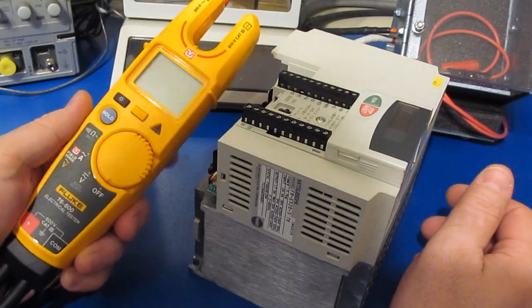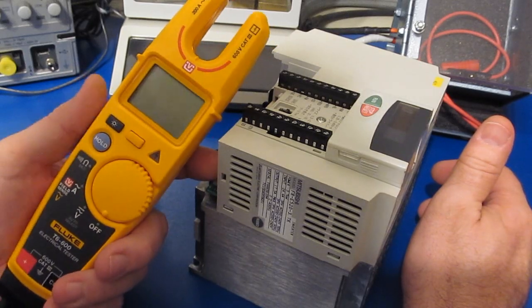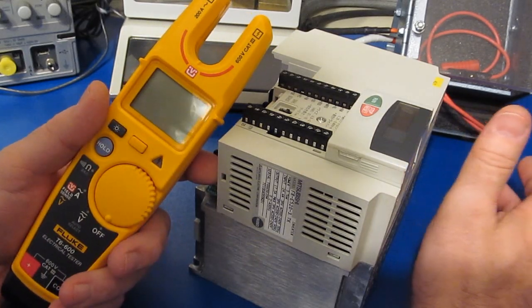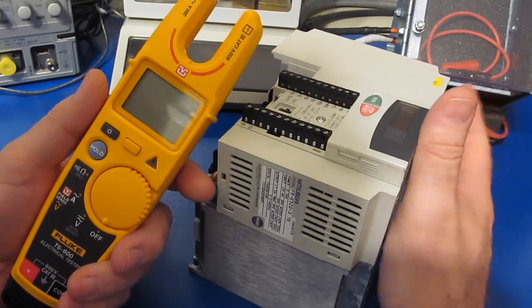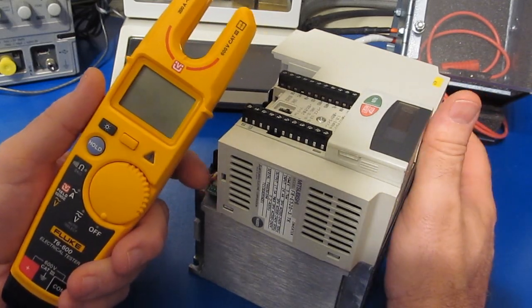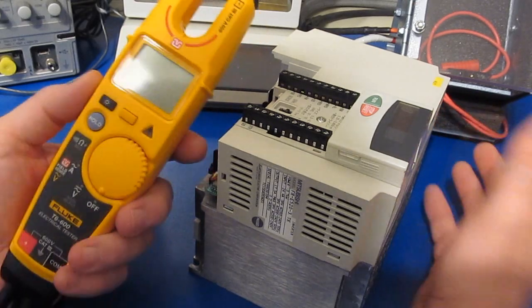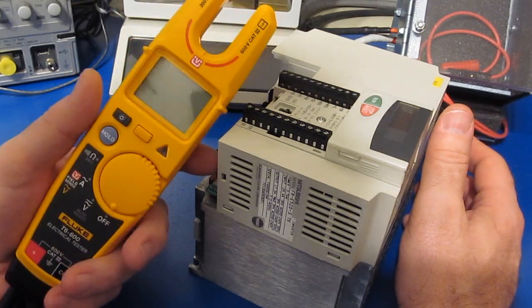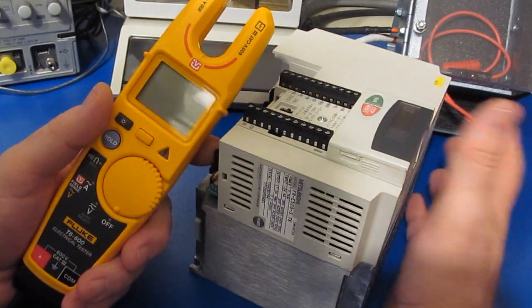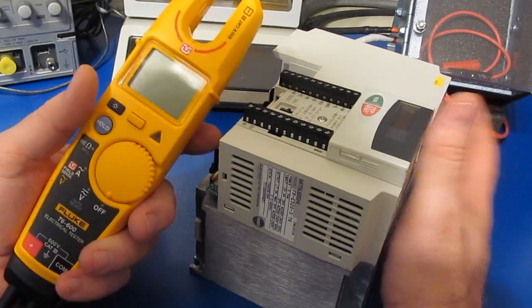Hello again and welcome. I thought I'd give you a quick update on this Fluke T6. I tried hooking this thing up to a few different sources. One of them was a three-phase, around a five horsepower motor. Unfortunately it didn't have a motor controller on it. I also tried it on a system that was using phase control. That system drew about 30 amps. This thing didn't have any troubles with either of those, but one of the things people have been asking me about was how this thing worked with the variable frequency drives.